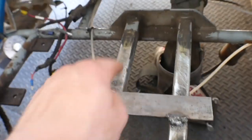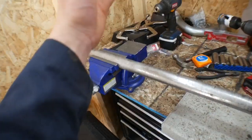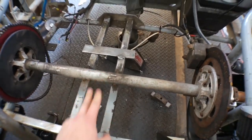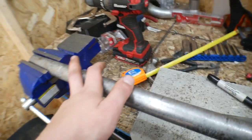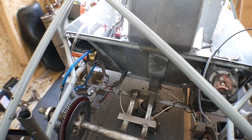This should go way faster than the thick pipe since it's thinner, so the hole dozer should go right through. What I was marking is four and a half inches — that's how tall I want the support to be. I chose that because it's four inches from the top of the axle, and a half inch of clearance should be enough even if it flexes. I figured it would be way easier to put this together first as a unit rather than welding piece by piece onto the arm. The first support is now cut.